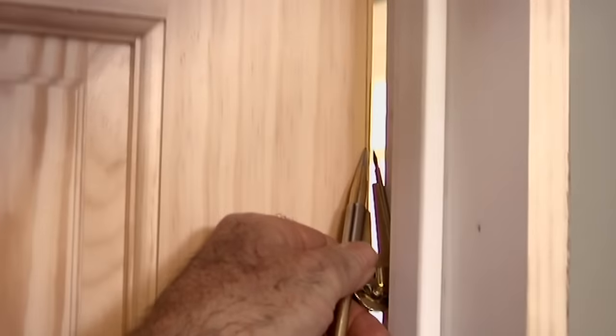When you drive hinge screws, make sure they seat firmly but don't overdrive them or they'll strip — and brass screws will shear right off. A good cordless drill is a real must. You'll notice I'm feathering the trigger just to be safe: when you drive a screw, don't squeeze the trigger all the way down. Drive a screw the way an old man drives a car — give it some power then feather it off, then give it some more power then feather it off. That way you have complete control of the torque regardless of the clutch setting.